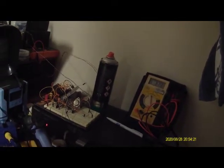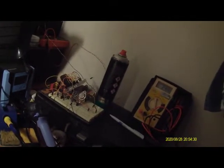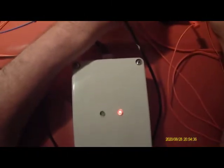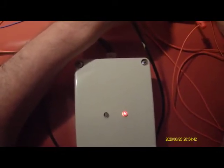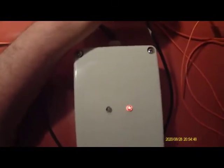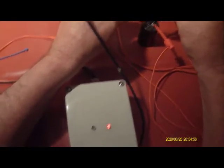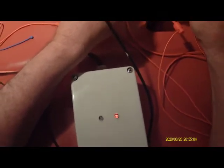This would be 46 volts, and it's going to take a couple of minutes to discharge. Obviously it gets proportionately slower as it discharges, but it's just to show the component calculations that Paul Carlson did. Because these high brightness, very very low current LEDs will still remain glowing down to less than the 4.3 volt zener diode that I've got across the LED, which is to protect the LED from high reverse voltage, which apparently they don't like.